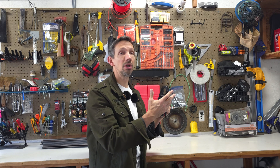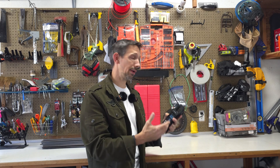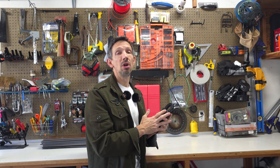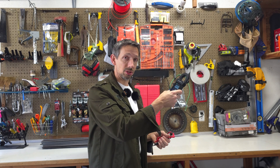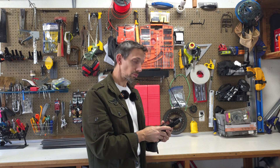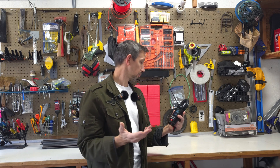You can also use this to test — maybe if you're removing a fan or a light fixture or putting in another one or doing different wiring — test with this. Make sure your electricity is off after you turn off the breaker. Then make sure you test it with a multimeter of some kind so you can be sure that you're not going to get electrocuted.